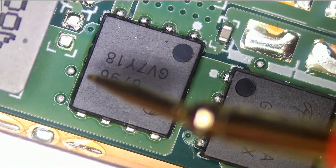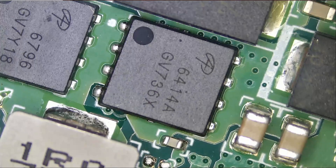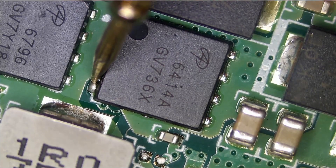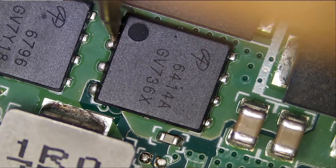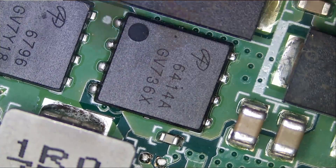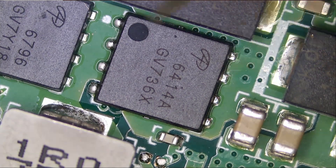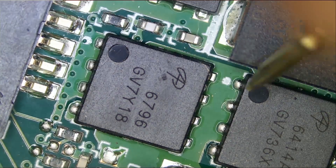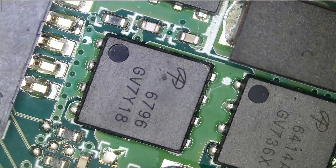There's definitely something wrong with this one — it's either a short causing this MOSFET not to work, or it could be the MOSFET itself. What about this one? The voltage at the gate is 3.5 volts, 13 volts here, and 3.5 volts here. These MOSFETs are probably for the USB-C port because of the higher voltage — 13.2 volts. We're getting 3.4 volts here. What about this one? Gate has 1.6 volts, 3.5 volts here, and no voltage here. The light is still on.